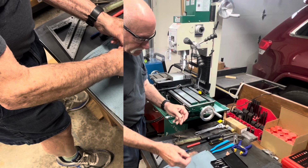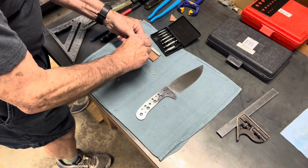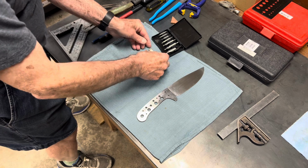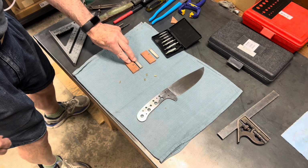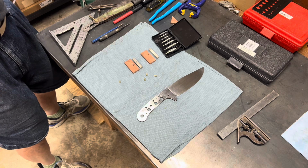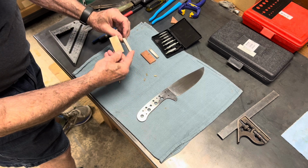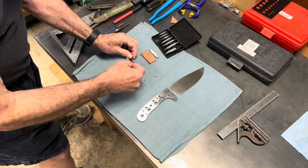Okay, so I've got these 2 as a matched set, because once you drill the holes that match, you've got to keep these right side up and matched and not mixed, otherwise the error will be greater. Here's what the assembly looks like. The holes have been drilled, and I keep these labeled number 2s, and these are number 1s. I insert the pins,